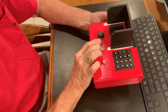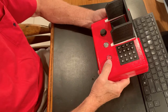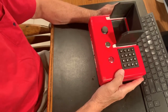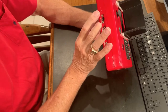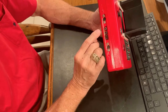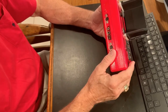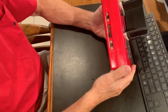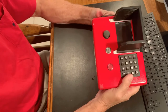It has a joystick, a main power button, and the most important red stop button to avoid hitting somebody or just deciding to make the robot quit doing anything. It also has a connection area on the bottom side with a battery charging USB port, a programming USB port. The Teensy has a reset and a program switch on its main card that I've replicated out here. And then we have a battery cutout switch that lets you remove the lithium battery from service when you're putting this in long-term storage.